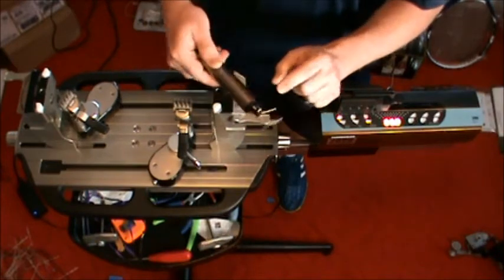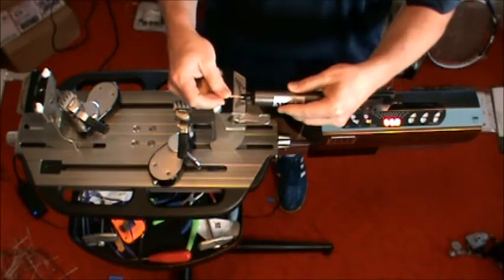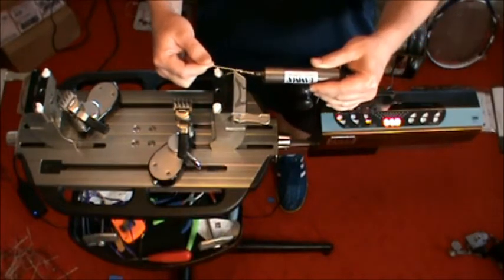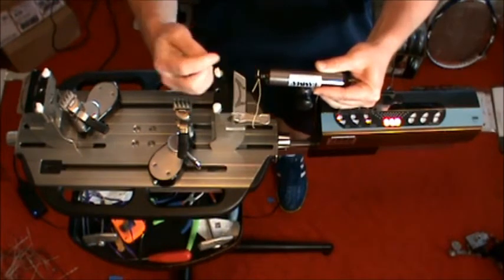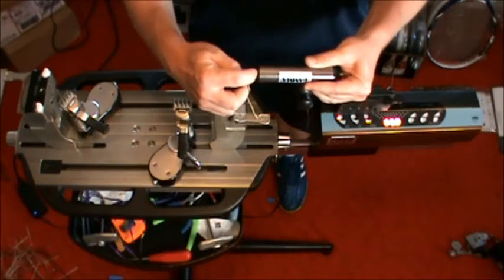There's pounds on one side, kilograms on the other, but there's incremental marks, and if you're looking at pounds, it's every 5 pounds, 10, 15, 20, and so forth. So those are sort of the numbers that you want to use when you're doing the calibration, and you want to be able to see the little line just barely. And if it's a constant pull machine, you want to still be able to see that line.